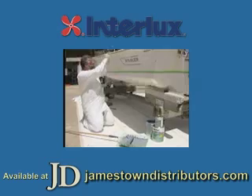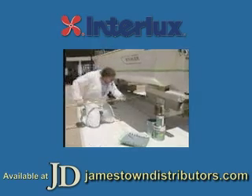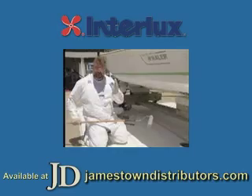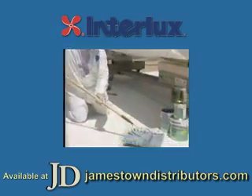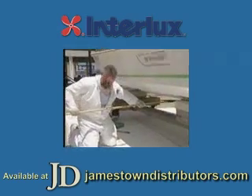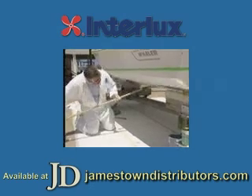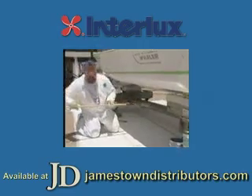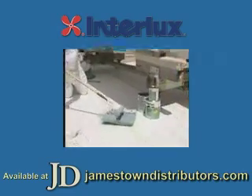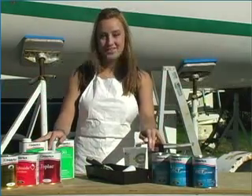Don't use the thin rollers here because the first coat of barrier coat needs to be very thick. If you use thin rollers, it's going to hurt you. We need to put a full 12 mils of protection onto the boat, which equates to about 2 full gallons. A little tip whenever you're bottom painting or putting on epoxy barrier coats: start at the very keel - the very bottom of the boat - and pull towards you, working your way out to the hull side. As you go in and coming out, you're not going to get into any wet material. Start at the lowest point and work your way up. We've got a lot of priming to do. You can find these Interlux products and much more at JamestownDistributors.com.